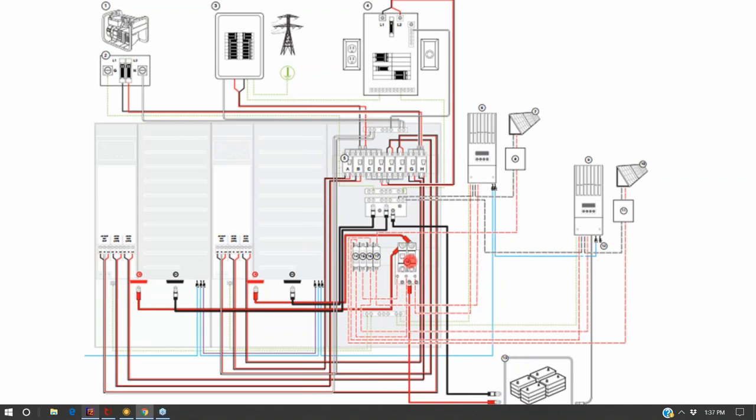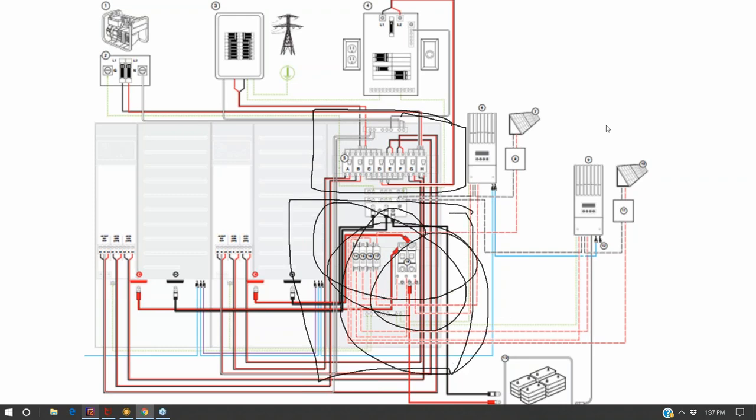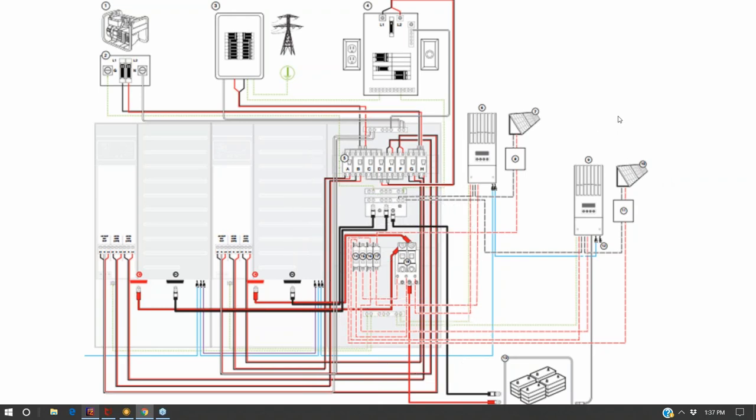And then here are large breakers that are coming off of our battery and going into our inverter. And so these are disconnects for the battery, and these are disconnects for the charge controllers. So there's disconnects for each charge controller, there's disconnects for each battery, a DC bus bar for positive, a DC bus bar for negative. And this is why Schneider sells this thing as a specialty device, because they actually have an AC side to this panel and a DC side to this panel. A cheaper way to do it is just to buy an AC panel and then get a metal box and build your own internals. But of course, it's cheaper, but it's not easier.